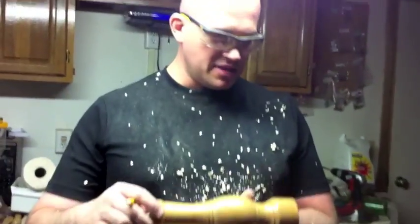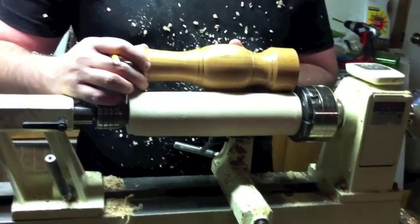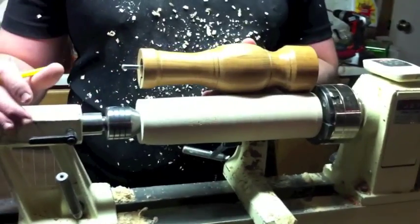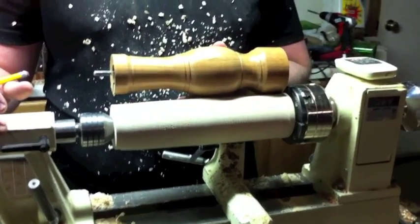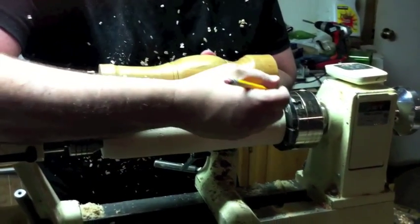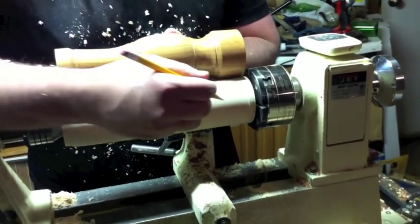I'm going to go to my model pepper mill — I've taken off the top — and I'm going to lay this down right on top of my maple mill. I'm going to not quite line it up at the very bottom because I'm going to reach in there with a parting tool to square off that end, and then the same thing at the top. I always cut them just a little bit long. On my maple mill, I'm going to mark some of my critical areas where I want to put some of the features.